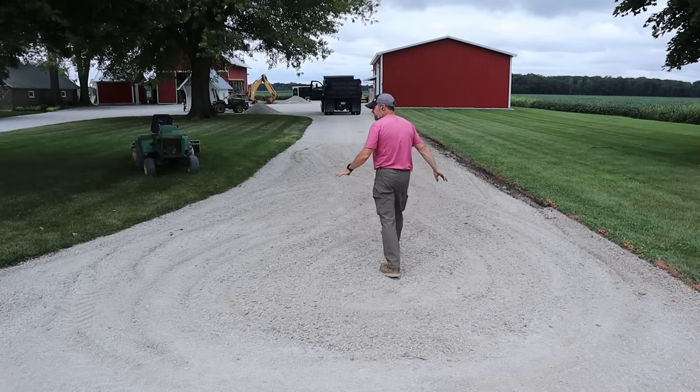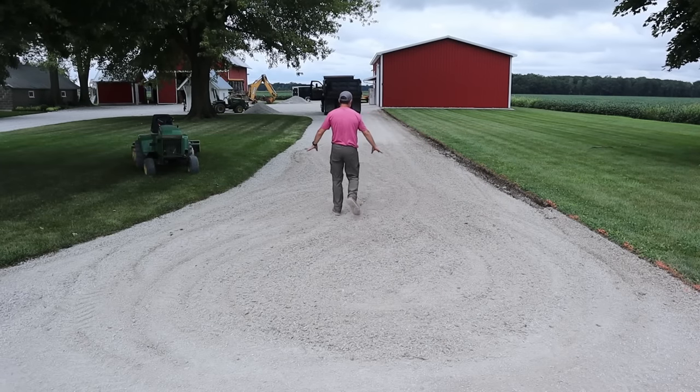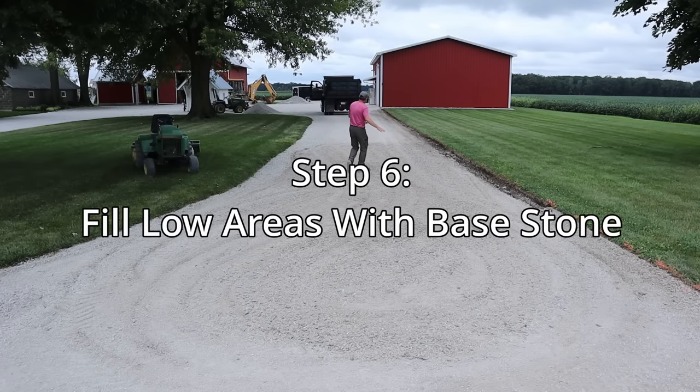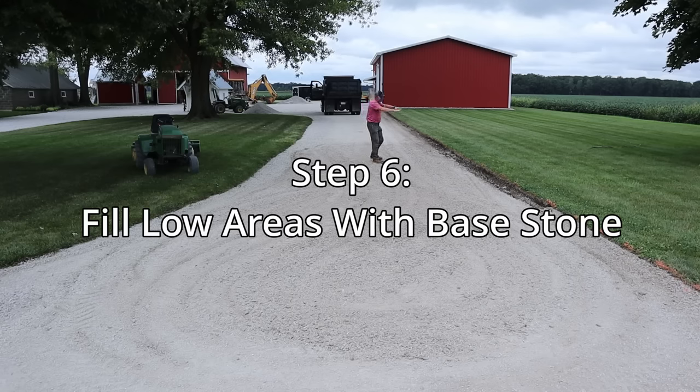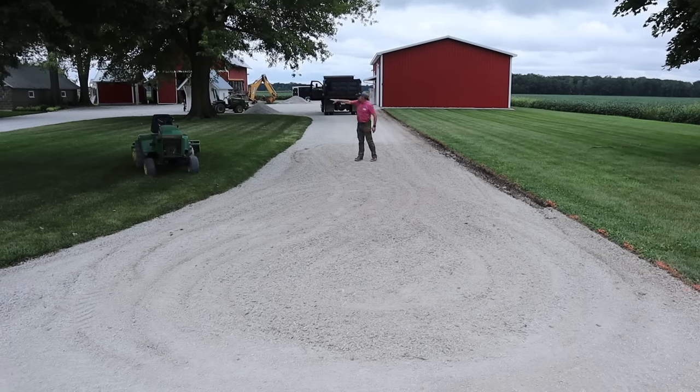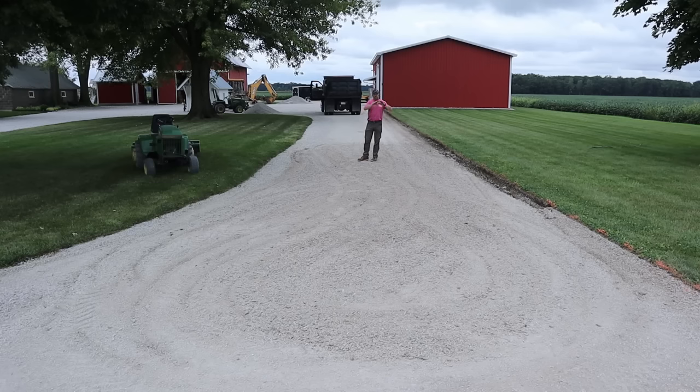Okay, the majority of the stone is gonna go up here where I've got it worked up and where I've added, you know, that dirty stone. I'm also gonna use stone up against the grass to fill in that groove. And essentially that's gonna taper, hopefully taper the driveway this way, get all the water to go down here. Then it's gonna run that way and it'll flow out that way. And primarily I just want it to get off the driveway.